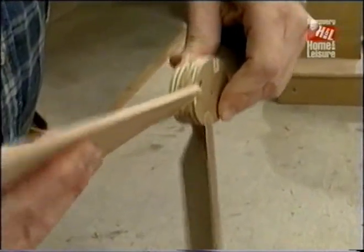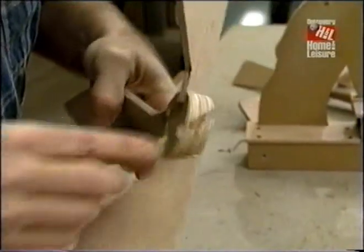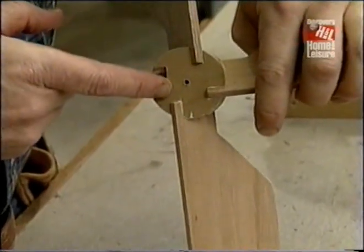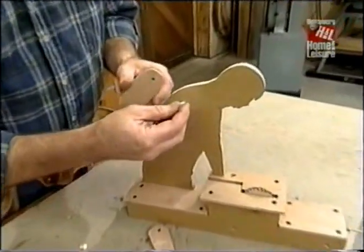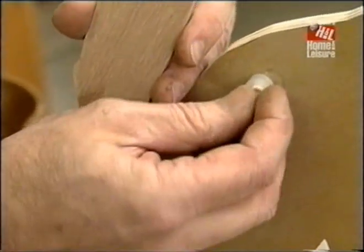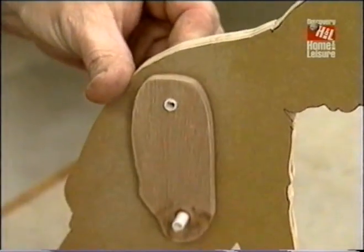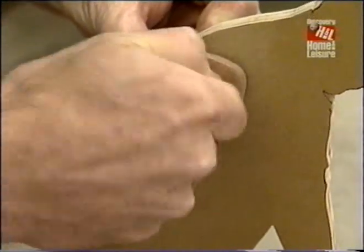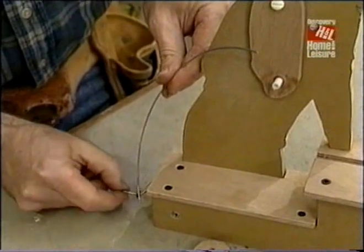That takes care of making the hub round and drilling the hole for the shaft. To make sure all the fan blades are identical, I've stacked four pieces of quarter-inch plywood together and wrapped them with masking tape so they won't move as I cut them out, then I'll sand the edges smooth. This carpenter's glue in a weatherproof version should do the job holding the fan blades in the hub. The important thing is to keep the blade centered in the hub — the reveal has to match on both sides, and I want to make sure it's thoroughly seated. While the propeller has been drying, I've epoxied a post into the body and at the elbow connection.